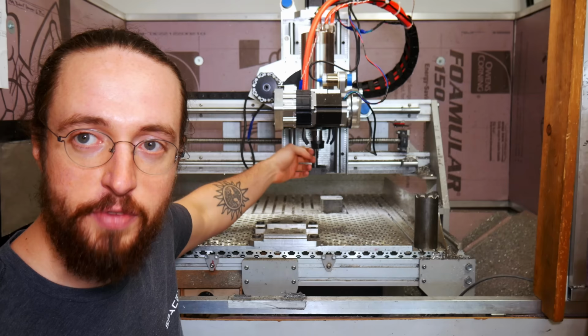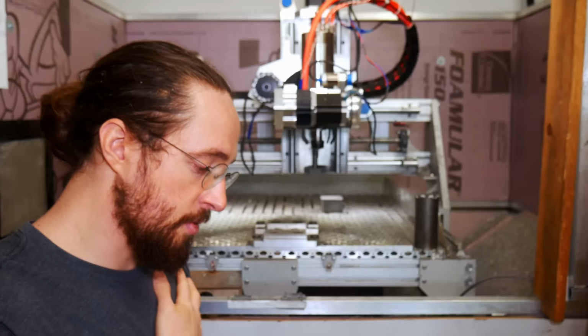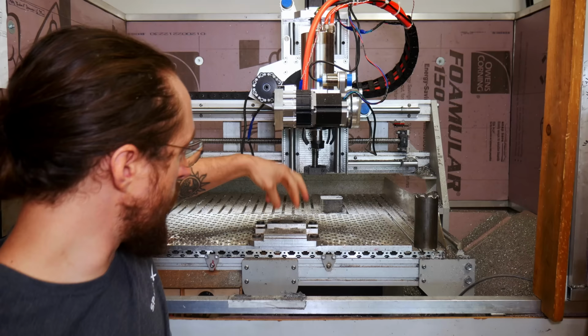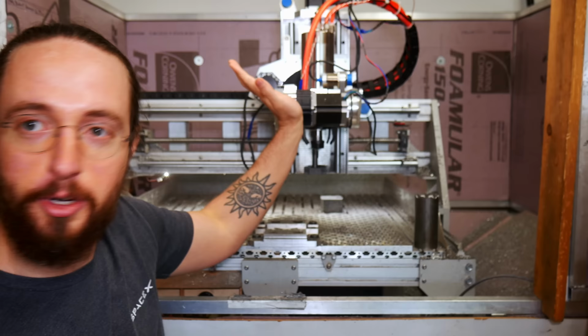The workaround I found for that is to go measure the offset, which I'm doing mostly with dial indicators, and then I measure the adjustment, and then I move the machine down to the position where the offset needs to be, and then I set a new work offset. So the work coordinate offset, usually G54 is the first one, I'll move it to where it needs to be in the correct spot when it moves to the angle. So let's say 30 degrees. When it moves to 30 degrees to be in that spot, I'd make that G55.